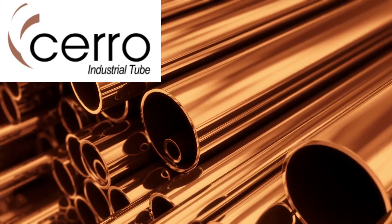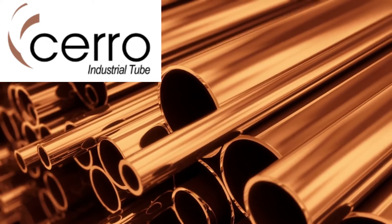You can fix this by having a coil that's tin-plated on the evaporator coil, or going all-aluminum — again, I think it's flow electrification. If you have a copper-aluminum coil, it's not if it will leak, it is when it will leak, because it will leak eventually. It might happen at 20 years depending on how much you use it. Most people that use their units quite a bit, running them more than most, their coils failed much sooner.